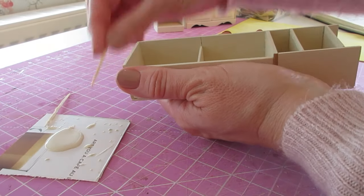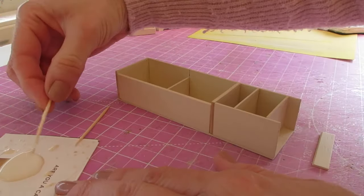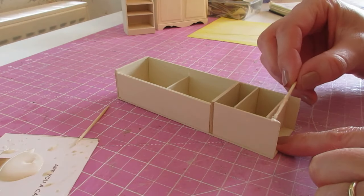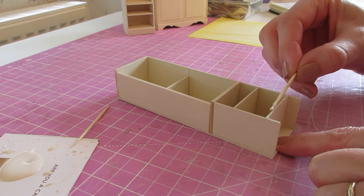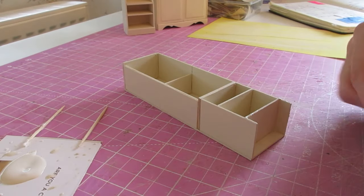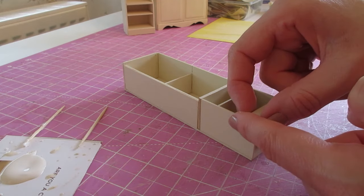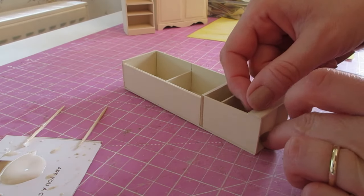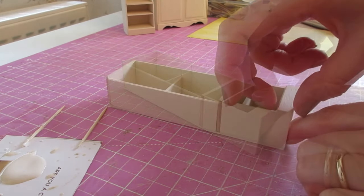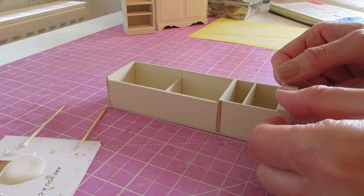Give it a press, hold onto that, and remove the excess glue. We've just got a final molding to put into place, then we can put some masking tape on. Apply glue to those bottom edges and sit the molding into place, making sure that it's not overlapping that bottom shelf. Check with your finger that you've got a nice flush edge so we can get the drawer in.